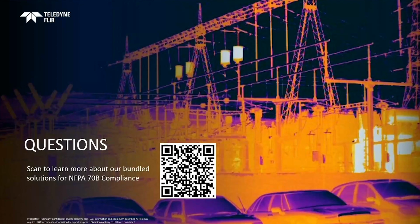One other thing that NFPA has also recognized is that load is critical. That brings up really two things. Number one, to check load, you have to have electrical equipment, say a current clamp, to measure the load of the electrical equipment. NFPA 70B says that there's a need of at least 40% of electrical current on the component to validate the temperature measurements. We all know that current drives temperature. So as we make this comparison, component to component or component to air temperature, it's critical that it be compared when we have a sufficient amount of load. So that's important also.